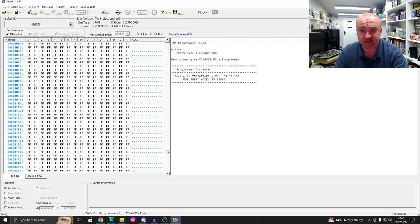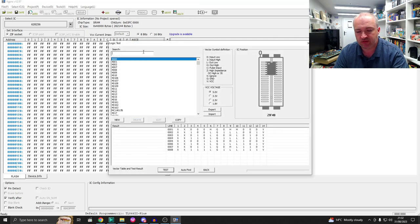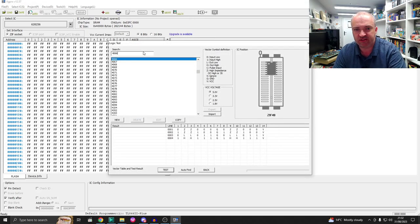Okay, let's test it. 4066. And yeah, it is bad. I think that's the first one of those that I've seen bad in a C64. My guess would be someone has plugged in something to one of the controller ports that wasn't compatible.